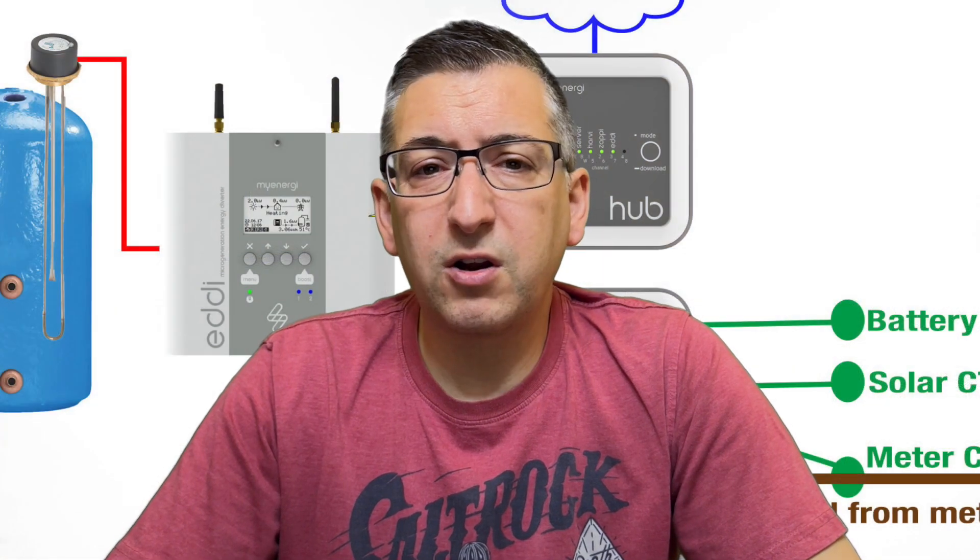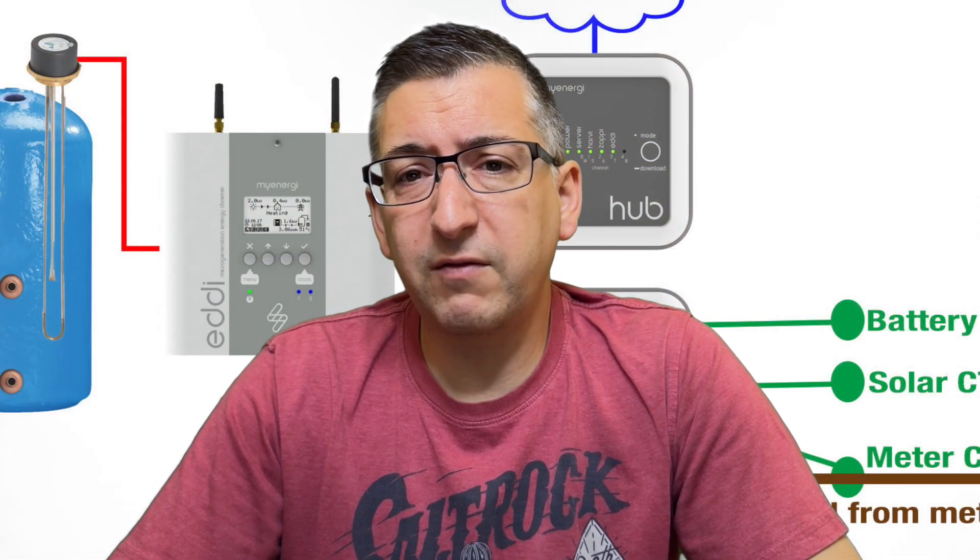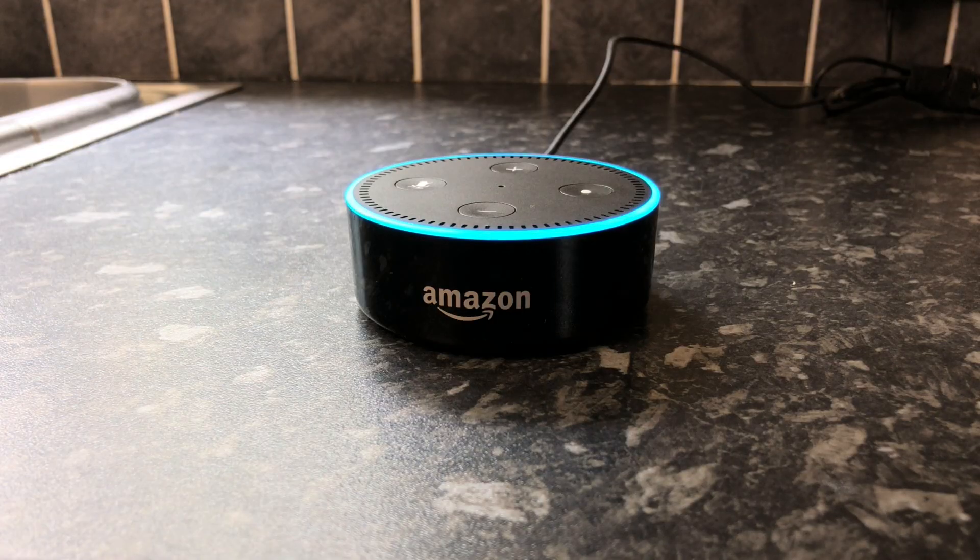I published a video not long ago about the MyEnergy Eddi solar diverter, which you can use to heat your hot water. But even if you don't have solar, you can get timers for your immersion heater to schedule a boost off-peak. They don't have to be smart — they can just be a dumb timer — but obviously they're a lot more fun if they are connected to your smart home. As for scheduling your other household appliances, a lot of them tend to have delayed start features. If you're lucky enough to have a smart appliance, you can use smart buttons to schedule them to turn on at the cheapest time. Have a look at the video I made about Home Connect Smart Appliances, which covers Bosch and Siemens dishwashers and tumble dryers — the same principles can apply to other brands too, with a few tweaks.